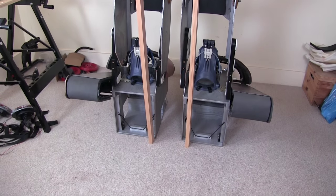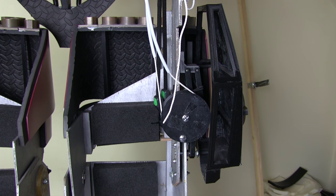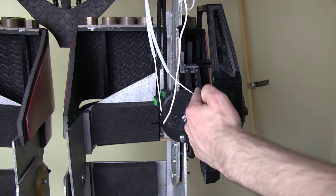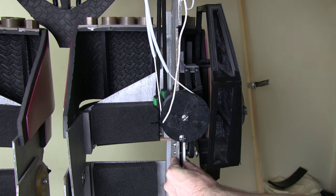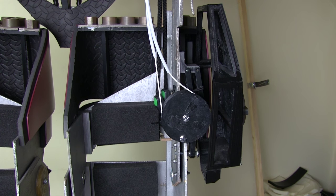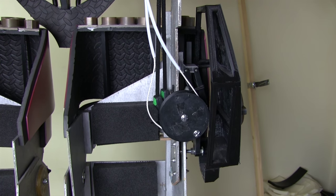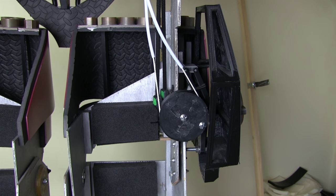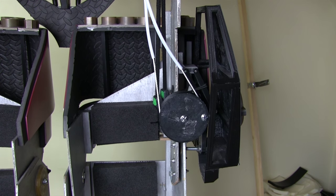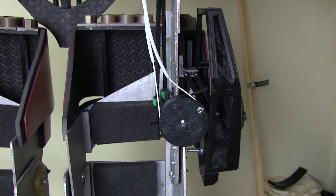I'll remove those just before I get in. What I really want to build for those locks is a cable-controlled thing where they're sprung in and that also holds them out. I did a very similar thing for the knee — the locking mechanism is a bolt that goes through the two pieces here, worked by turning a piece that has a bolt on it and pushes that bolt out. The bolt is sprung and on a four-bar link, which means it pops in. If you go far enough and it turns past a certain point, it's sprung against an end stop so it stays there. That's how the knees work.